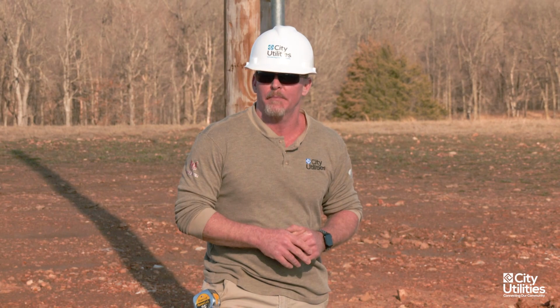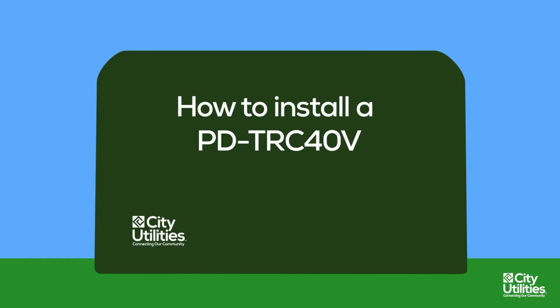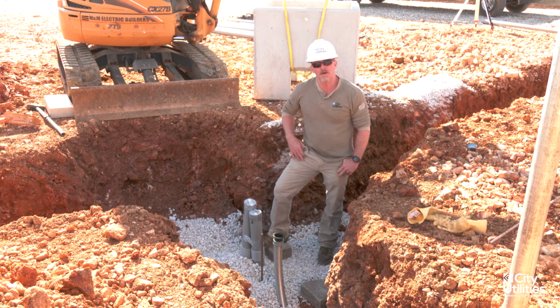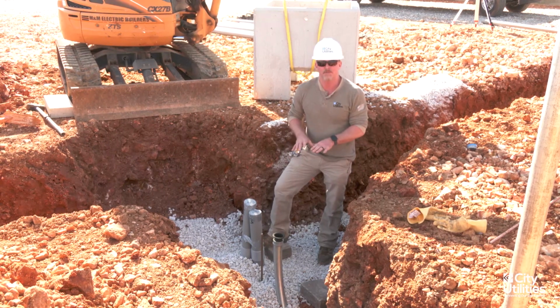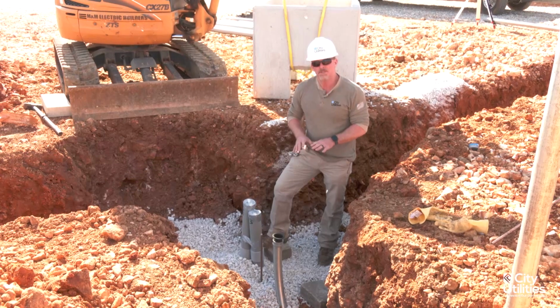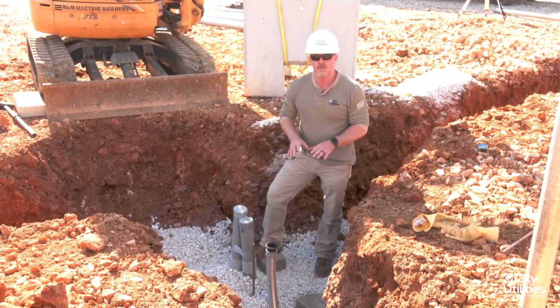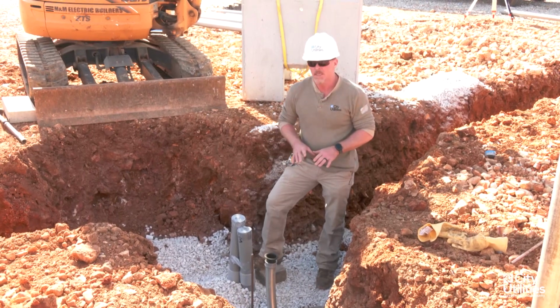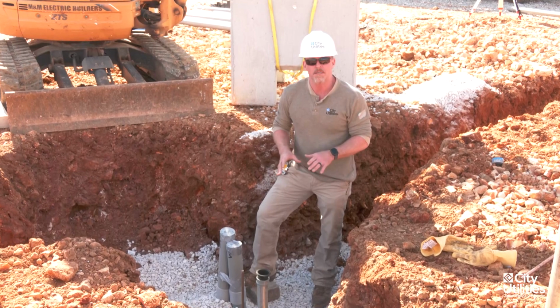Today we're going to be talking about an installation of a PD TRC40V. Okay, so what I'm going to be showing and talking to you about now is the best and easiest way to put this in. The best way to do this is dig a ditch somewhere between 48 to 55 inches deep, depending on how your elevations are. And all your piping and plumbing, including your secondary side, will be installed at that time.